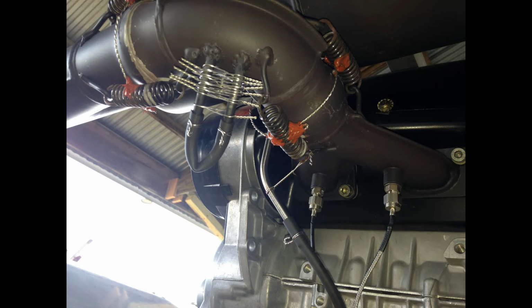So on a 2-stroke engine, the exhaust is tuned, and the tuned exhaust is essentially what makes up the exhaust valve on the engine. And the tuning is very important. That tuning depends on the length of the tuned portion of the muffler. It depends on RPM, EGTs, and a lot of factors. And what I found when I was injecting smoke fluid into this elbow was that the engine would pick up 400 to 500 RPM. That was happening because the fluid was going into the exhaust and cooling it off and changing the timing of the pressure pulses inside the exhaust.